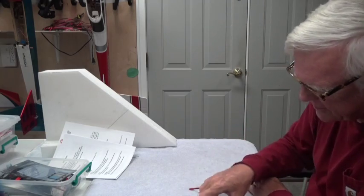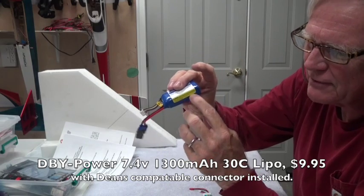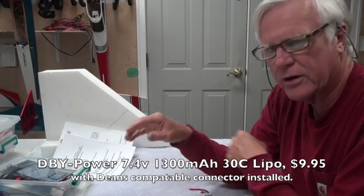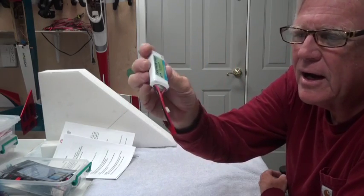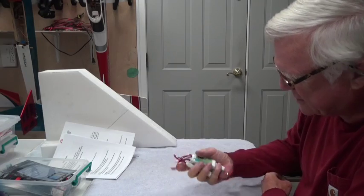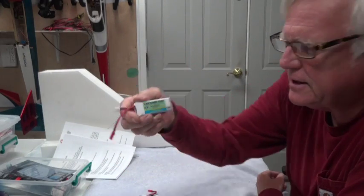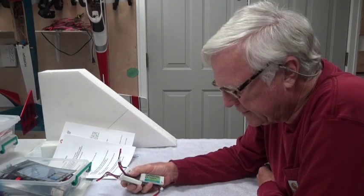I almost forgot to talk about batteries — they're kind of important, you can't fly without them. I didn't have any 2S 1300 batteries; I've got 3S 1300 batteries. The 2S is the same size in one dimension but thinner since it's 2S instead of 3S. I'm going to be using 2S 1300s — they're on order from Heads Up Hobby. I do have some 2S 950s that would work, though they're slightly longer and only 950 milliamp hour so they probably wouldn't last as long. I've got 1300 milliamp hour batteries on order and we'll see how they work.